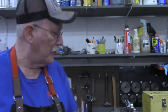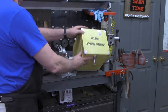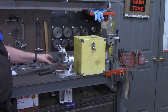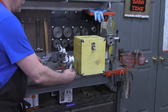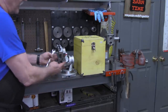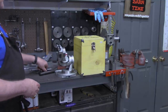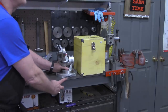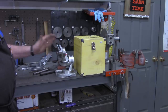What I'm going to use to hold these in the surface grinder is what's called a universal sharpener. This is meant to be used on grinders, tool grinders, surface grinders, and could possibly even be used on a mill. It has four different axes that you can adjust. I've got this set now at 90 degrees, this axis at zero, this axis at zero, and this axis pulled back to 30 degrees to give a 60-degree included angle on our chisels. It also has a stop plate on the front that will line up against the mag chuck on the surface grinder.